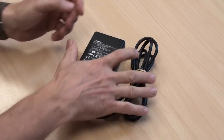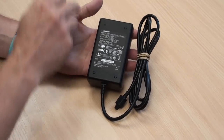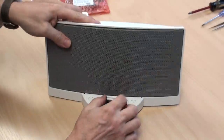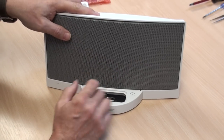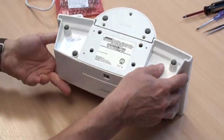If you can, borrow a power supply from someone else — quite a few people say they know it's not their power supply because they borrowed a friend's and the dock still doesn't work, but their power supply works on the friend's dock. That obvious swap test is worth trying. But this 208 stays cold even when working, so you cannot use the heat test on this shorter power supply.